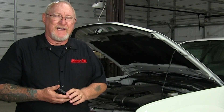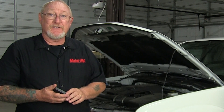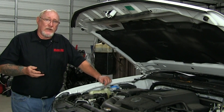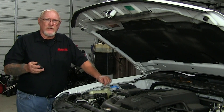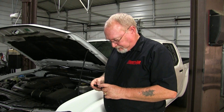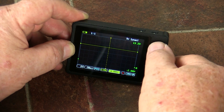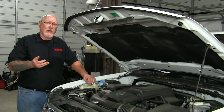Now on to your first test — it's a simple battery test you can perform in just a few minutes, and it's a great service to offer customers. Start by setting up your scope to the 2020 rule, then adjust as needed for the test. Since the starter will be cranking before the engine is running, let's bump the time up to 500 milliseconds per division for a total sweep of six seconds. I like the single trigger option because it lets me start the scope and then leave it while I start the car. What voltage level would you choose?